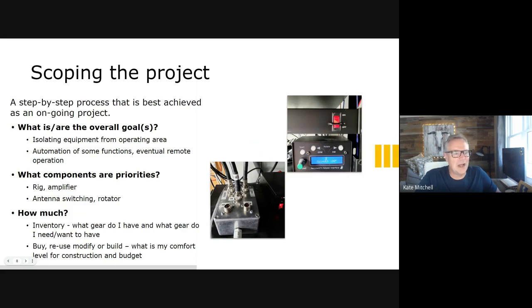Using the Raspberry Pi made that rather simple. I installed a serial to network server on the Raspberry Pi, and then I could address the Arduino as if it were a COM port or a serial port directly on my PC. And I use PST Rotator, by the way, as an application to control the rotor. That worked out quite nicely. It was very simple to do. The setup took no more than really 15 minutes. An Arduino, for example, with an Ethernet shield could be directly IP connected, but in this case, my intermediary device just happened to be a Raspberry Pi.